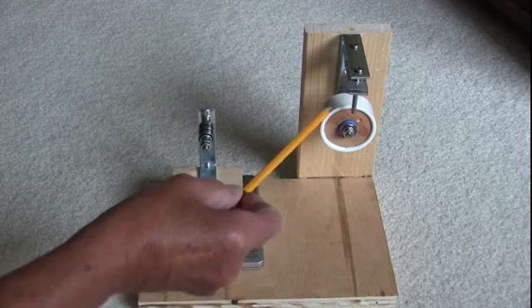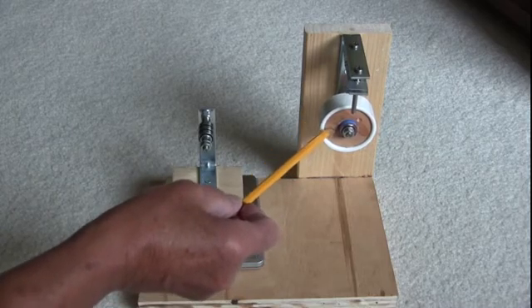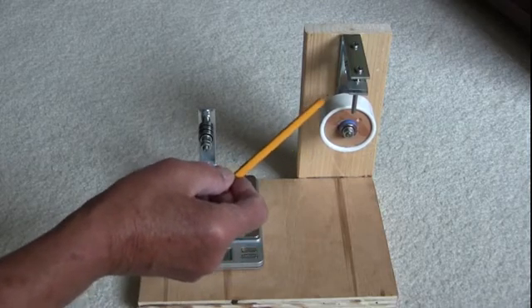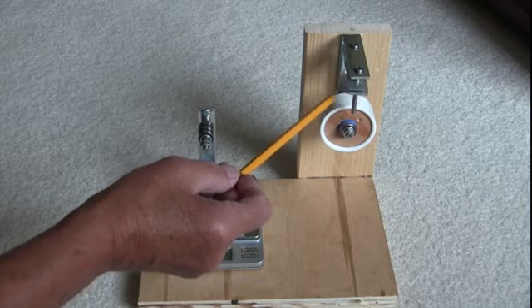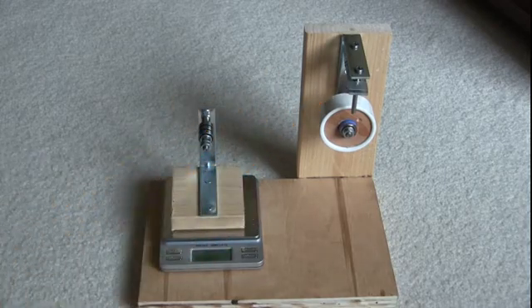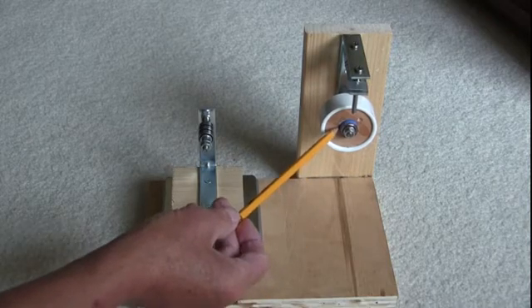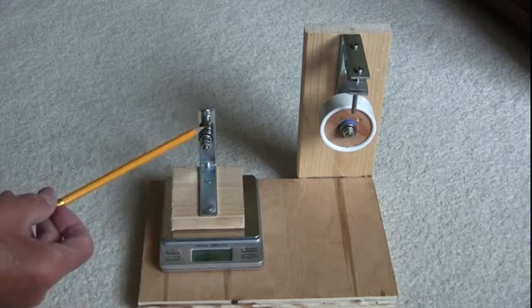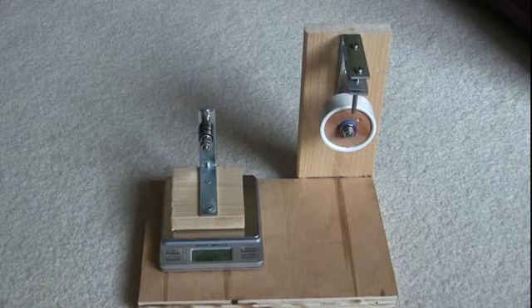This little adapter I made out of a piece of wood cut with a hole saw, and then I cut part of a PVC 90-degree elbow to make an outer rim for that little wooden wheel. This is set up for the big end; the little end would go here. These bearings are available from Amazon — a quarter inch by five-eighths, coming in a pack of ten for $11.99 (2019 prices).